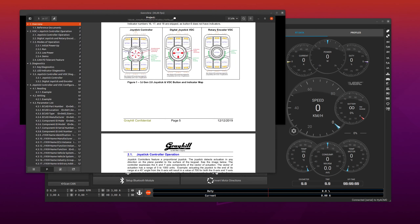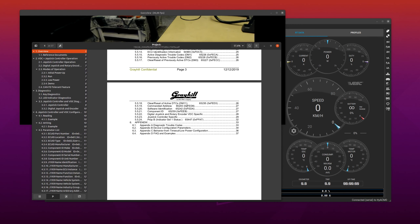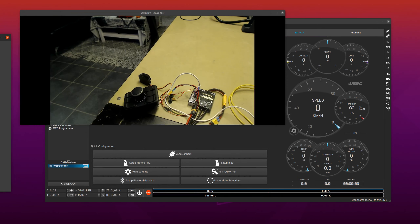Once you have the joystick there is also a data sheet where you have to figure out how to communicate, and that was a bit tricky because there are different models — some have an analog stick, some only have four directional buttons, some you can twist and some you can't. We can start by trying to receive CAN frames from it. Sending CAN frames is obviously easier because you just use the send CAN function; receiving requires registering an event handler, which is slightly trickier but not that bad.